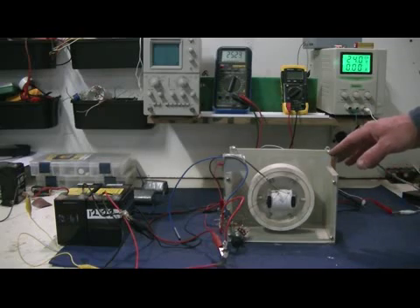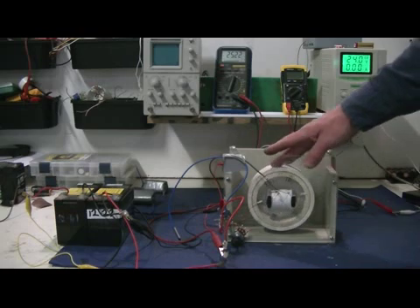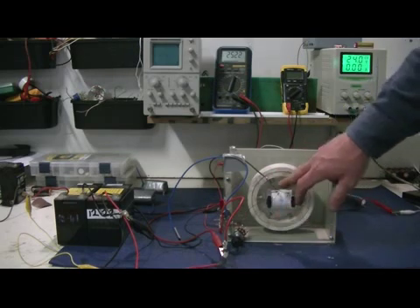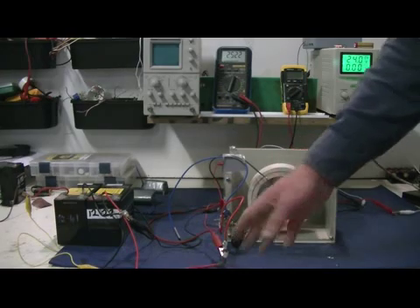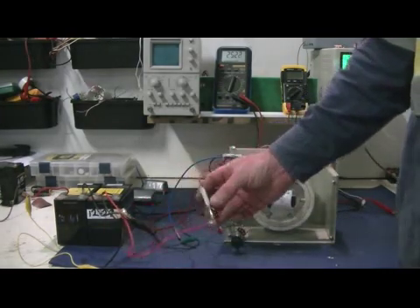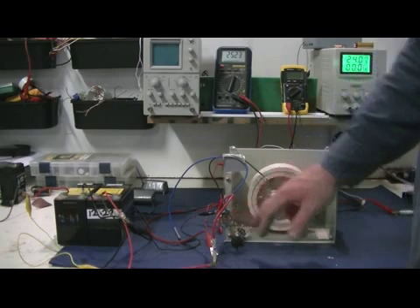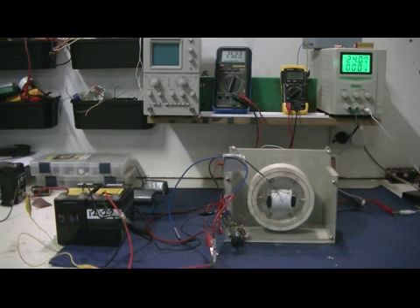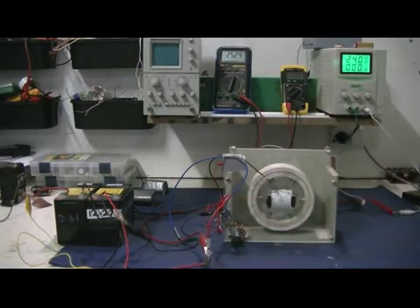Power consumption — that's gone up for some reason, I'm not sure why. And I'm not too sure about having the two magnets top and bottom in close proximity to the coil when the field wants to collapse — I don't know what effect that has on it. But the current draw has gone up, but the output on the charge side has gone right off the scale. I borrowed the two 240-volt neons and put them on here just to make sure we were still getting the high voltage spike, and it blew into pieces. So there's a whole lot of power coming out of there.